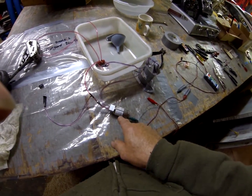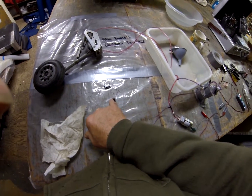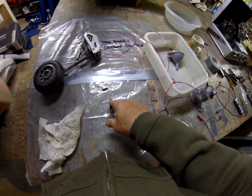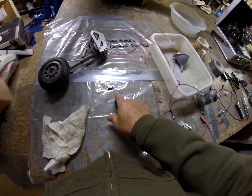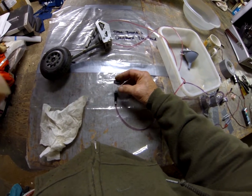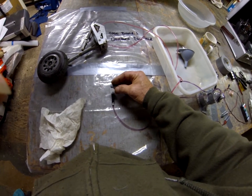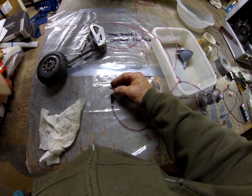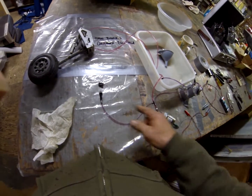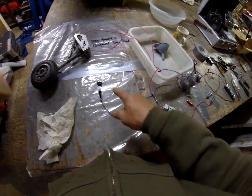There's a hydraulic pump, and here's how I'm going to control it. Watch this pin — when I throw that switch, the pressure will drop and the pin will drop. When it pressures up, the pin will come out. I'll have this micro switch mounted so when the pressure comes up, it trips and cuts power to the motor. The second pressure is relieved for any reason, the switch engages and the pump will repressurize for whatever mode it's in.